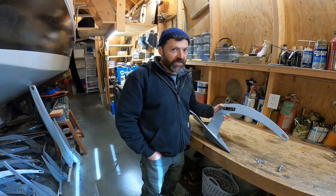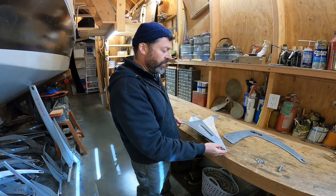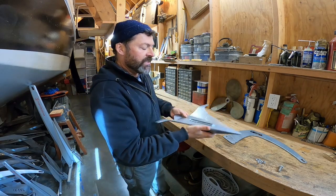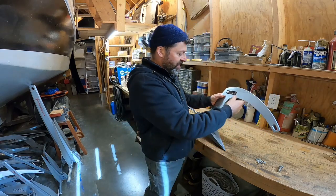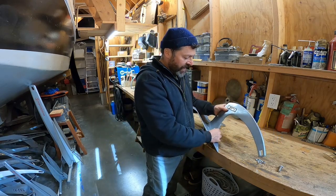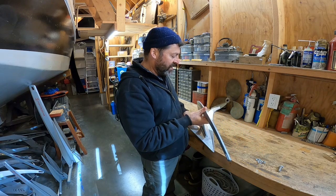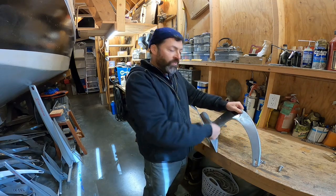The shank, which is cut from a single piece of plate, is removable. The fluke is made of two pieces — the forward half was cast, I believe, and the rear portion is plate, welded together along this line and perhaps around this structure here. This slot that the shank fits into is all cast, and as a result I believe the tolerances had to be kept fairly loose because casting just isn't a very precise way to create a shape. The result is quite a bit of wiggling, but there's really no structural problem with this — in fact, it might be a good thing. Having a lot of slop between this junction means that mud and debris that may collect there would be easier to wiggle out.